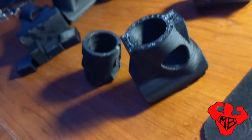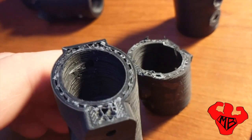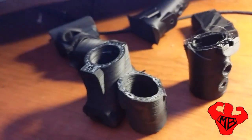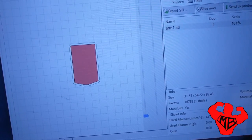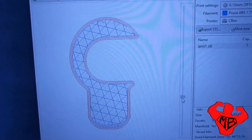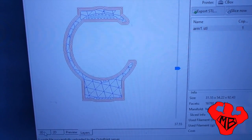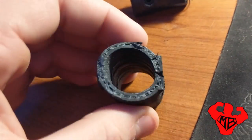The infill pattern on this one was rectilinear, and with rectilinear prints you're going to experience a lot of issues. The other thing I did was download the new Prusa Special Edition version of the slicer. In this version, they give you a special infill type called cubic. If you look through, you'll see how you end up with little triangles instead of little diamonds. With rectilinear you'd have diamonds and squares. This rectilinear print didn't get good layer bonding because it's a rounded part. The triangles bonded very well — they bonded strong.